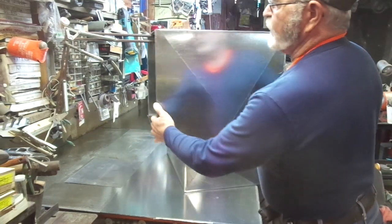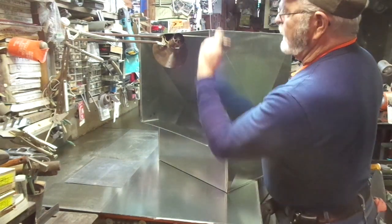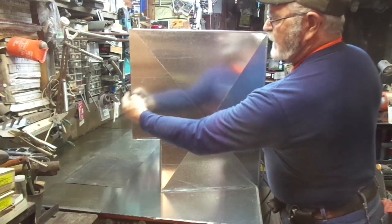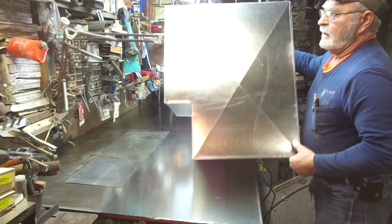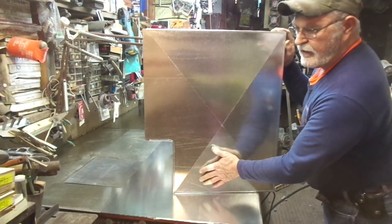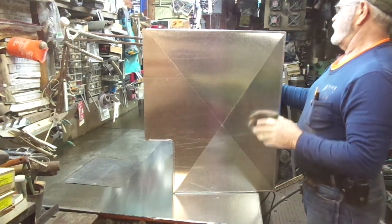To reiterate from the start: this is the opening that's going to be attached to the back of the air handler in the attic. I've got one flange so it can be screwed onto the back side, and the other three will slip over the outside edges because it's a non-flange bottom of the furnace. That's going to be the return air going that direction. This is a sealed compartment right now. This area right here will be flush with the bottom of the drywall, and when we cut the drywall we'll cut the hole out and the return air filter grill will insert right up through the drywall and into this. This is the return chamber going that direction.